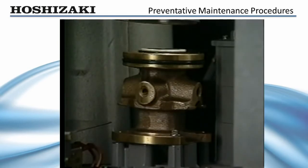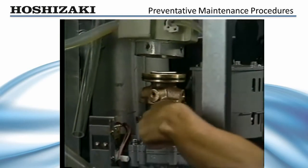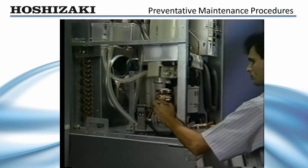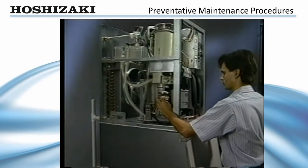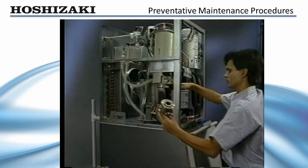The housing and cylinder are sealed by an o-ring. Care should be taken to protect the o-ring for reuse, or replace it if necessary when reassembling the unit. Remove the bolts at the base of the housing and remove the housing to replace the lower bearing. Have the bearings repressed and replace the parts in reverse order.